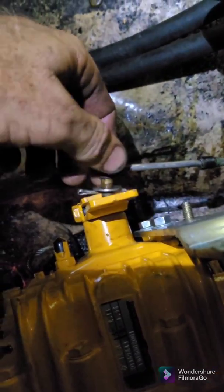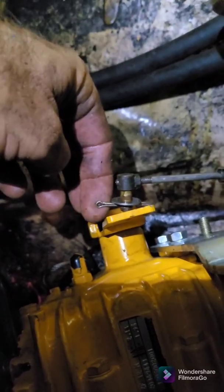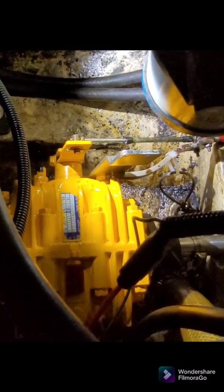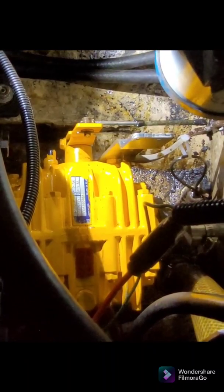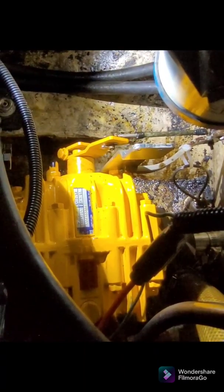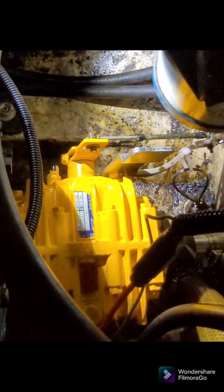To make the cable come back and forth, we've got this aluminium plate and a little holding bracket. I've fitted a bolt through there and I'm going to get a nut on it to tighten it up, and then this cable end will fit through the gear shift lever and be held in place with a split pin. We've attached the gear shift cable and we're ready to just check how she runs. I've asked my crew to go up and gently shift into forward, then back to neutral and into reverse. Forward, neutral, there's reverse, and back to neutral.